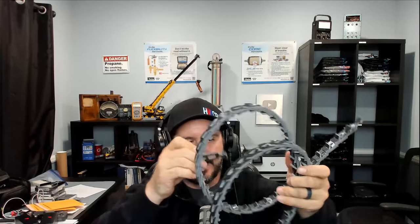In the video I referenced an emergency belt — you might call them a link belt or emergency belt. This is the B belt version. It has little links and you basically add and remove them to make the belt longer or shorter. These are great to keep in your truck. I try to keep one in an A belt and a B belt in every vehicle for emergencies, but they're rather expensive so I don't use them on a regular basis. They'll get you through a weekend if you have a broken belt and don't want to call out the supply house.